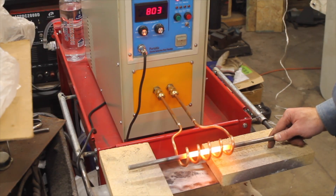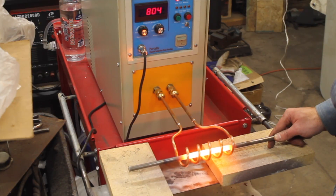I also tried some 5/8 inch diameter sucker rod — that's what I usually use for tongs, 5/8 or 3/4. And if anything, it heated faster. That's counterintuitive, but induction heaters are often that way because the larger stock actually couples with more magnetic flux, so it can dump more heat into it. I'm pretty happy with this coil.